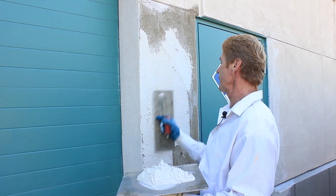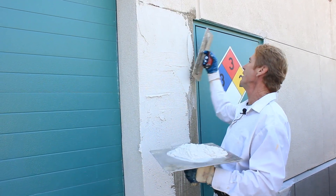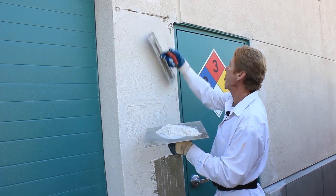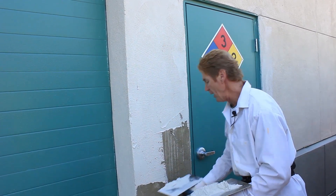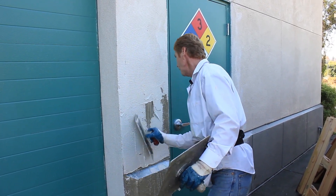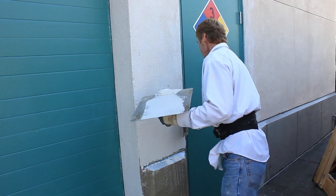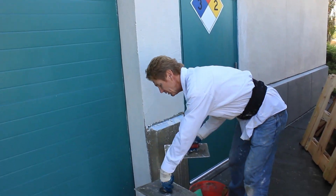What we do is apply the finish coat now. Don't worry about burying your joints, your expansion joints — just cover it all up, cover, as you can clean up with your float. I'm going to take it right down to here and show you what I'm talking about as far as the texture. This is the way I would do it. There are some guys who can possibly match this texture if they spend a long time — like my buddy Fred Smith, Danny Smith Plastering — he is a master at this stuff. But I kind of like to do it this way: it's faster, it's right on the money.